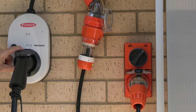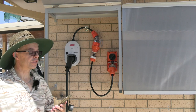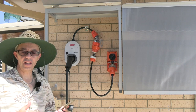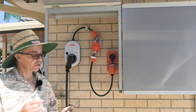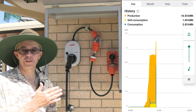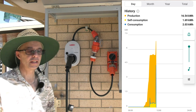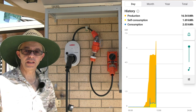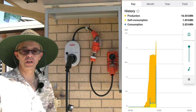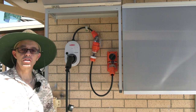We're charging with excess solar — what we're not using in the house, the car is now consuming. I'm taking a screenshot from our Fronius Solar PV app showing today's usage and excess solar being pumped to the grid. That screenshot will show the point where we plugged in. We have an 8-kilowatt inverter, and in Queensland there's a 5-kilowatt export limit, so anything we generate over 5 kilowatts is otherwise wasted. Towards the end of the video I'll do another screenshot to clearly show how much energy went into the car.